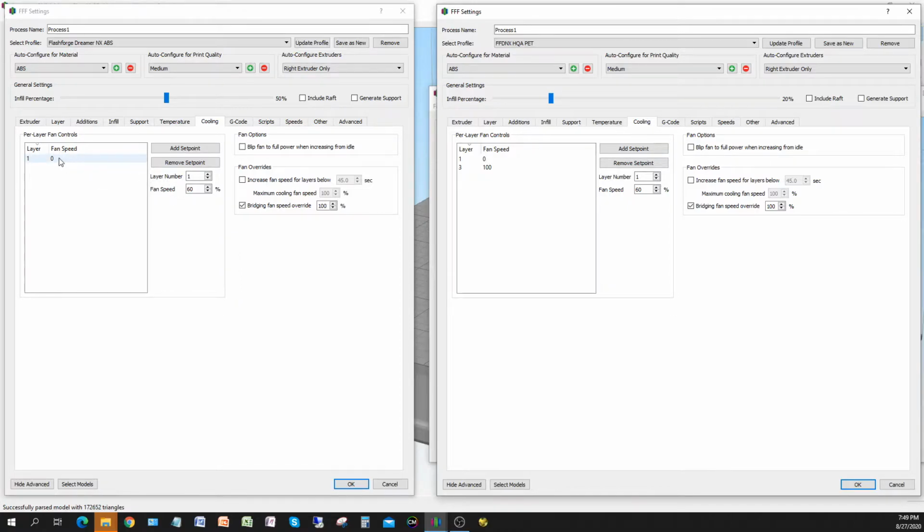And here they just have you let the slicing software figure out what the cooling should be. Here we said after the third layer, put 100%. That's my experience, and what this other website said, which I'll put a link in, said that 100% after the third layer causes the PET to cool very quickly, and so you don't end up with blobbing. They said the parts might not be quite as strong, but I'm not really concerned about that. I don't think that's going to be an issue.